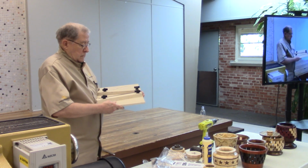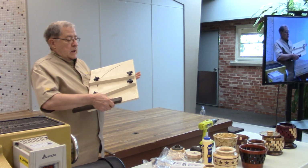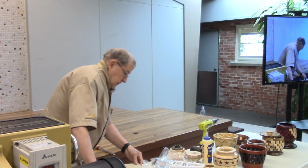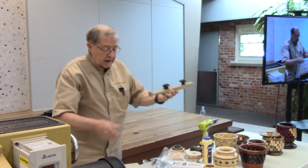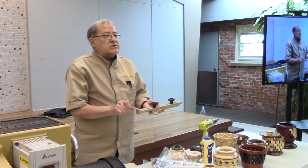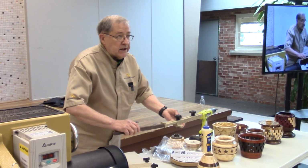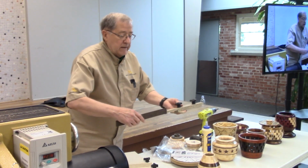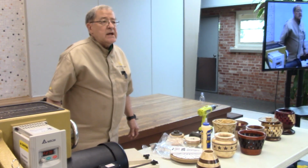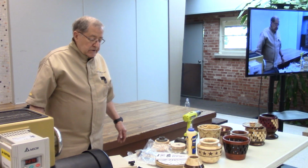put it on the table saw with the runner so it's set for you. You put this in with the segment or a piece of wood that you're going to cut. And this is a stop that you put. You can adjust it back and forth to make the segments longer or shorter. That way your segments are all the same length. So you butt it up against that and go after it. Flip it, go after it. Flip it, flip it. And make as many as you want, which I make out of 16 segments. I usually make 17 in case one of them messes up or gets a nick in it or something.